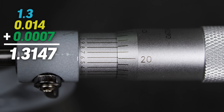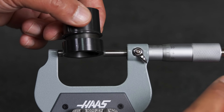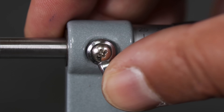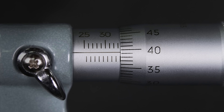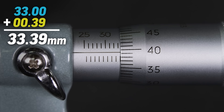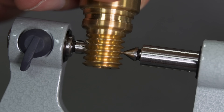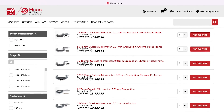Now let's take a reading. We can use the same part to measure with the metric mic. Here we have a 25 to 50 millimeter mic. Using the same method as before, you can see the ratchet is clicking. Now I'm going to lock the spindle and slide the carbide surface off the part — again it feels smooth. I'll leave this here for a few seconds so you can try taking the reading yourself. Congratulations if you got it right — you must have been paying attention. That's the basics of an OD mic and that's just the start. Look out for more videos each focusing on the mics mentioned at the beginning of this presentation. All of these mics are now available on hasstooling.com under the metrology tools tab, so check them out and thanks for watching.